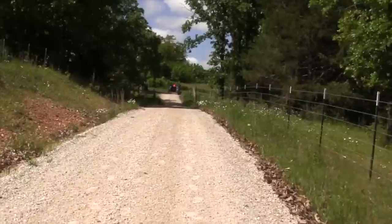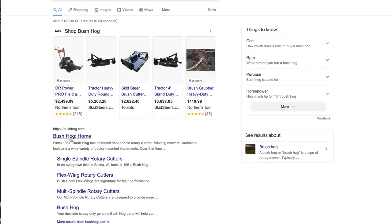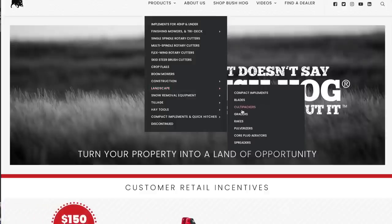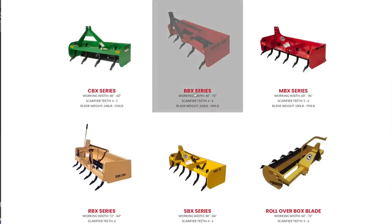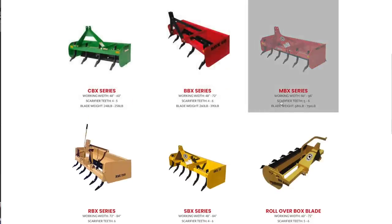There are really three different types of manufacturers that build box blades, Leroy. First off are the people that specialize in perceived premium quality attachments — the Bush Hogs, the Rhinos, the Woods, the Land Prides of the world. Their quality will generally be really good. The dealership I worked at sold Woods, Bush Hog, and Rhino. All three companies had a basic blade that was their price leader, a medium grade blade that was a step up with heavier metal and better welds, and then an industrial grade sold to landscapers. If you compare the intermediate grade with the industrial, or the introductory with the intermediate, there's a big difference.